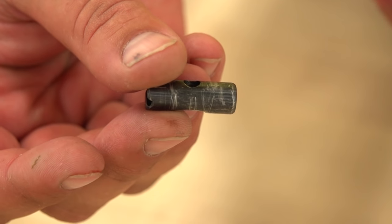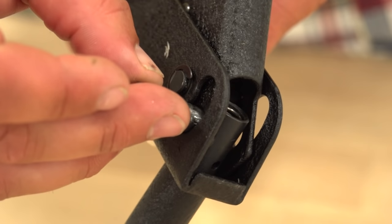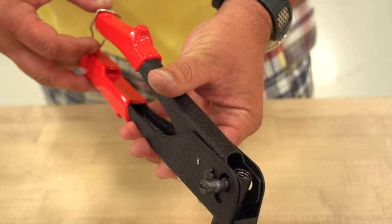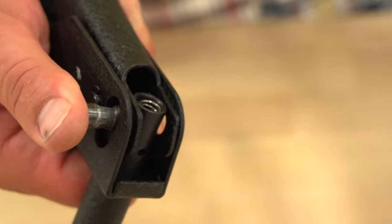Take the pin and rotate it around. You will notice a flat side on the pin. This flat side should face up when inserting it back into the hole. Push the pin in while slightly depressing the handles up and down as shown in the video until the pin enters the side hole. Once inside the first portion of the hole, lock the handles in the down position again.